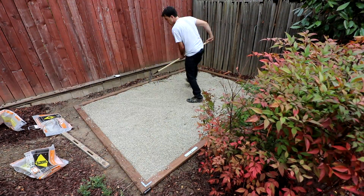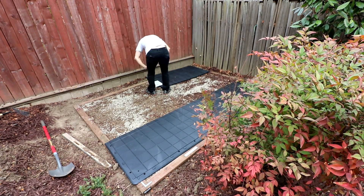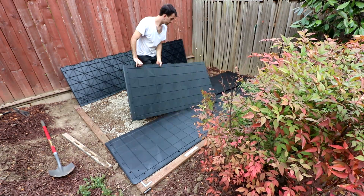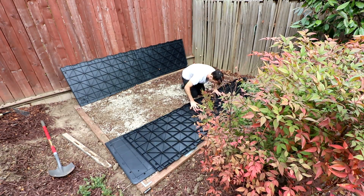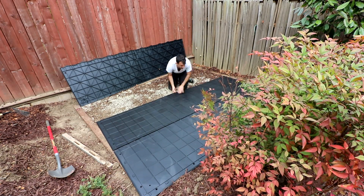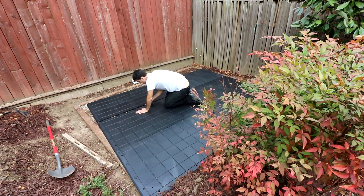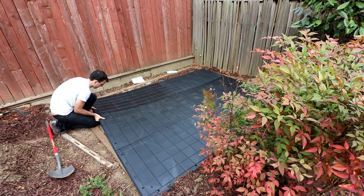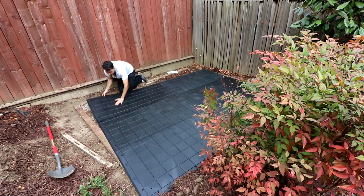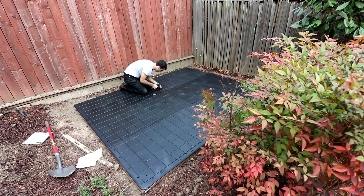Pavers will work. Concrete will work, it's just much more difficult to do that. The next step was to start with the foundation — I had it all leveled. I leveled out the gravel with a piece of wood, just running it across. The foundation is about six different pieces. Something to note is the screws that connect the foundation are with the heavy box with all the gutters in it — they're really hard to find, not with all the rest of the parts. So do make sure when you get this box, you open all the parts up and look through it. I recommend the first thing to actually do is open up your box and get all your parts out and spread them out. Also be aware of the way they mark the parts — there might be a part number on the top or the bottom, and some of the parts are reversible.